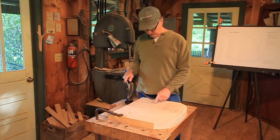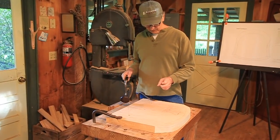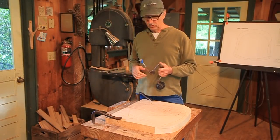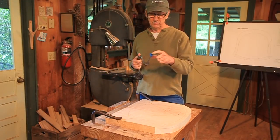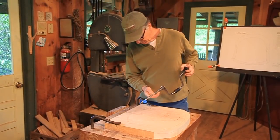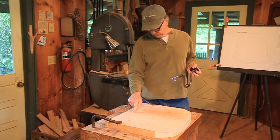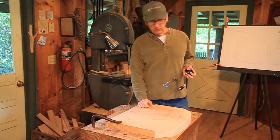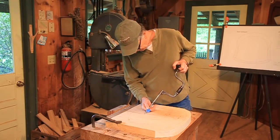The first thing I'll do is drill a depth hole — I'll typically use a twist drill with an egg-beater drill but just trying to use what I've already introduced. We used a half-inch auger to drill that with. Just make sure you're counting the tip of the lead screw as part of your depth. It's going to go about 15/16ths deep — three and a half inches in — or you just look at the contour map and bore wherever you want according to that map.